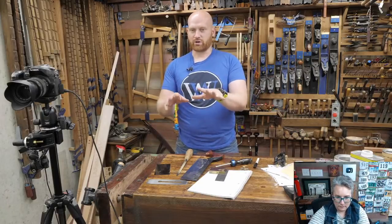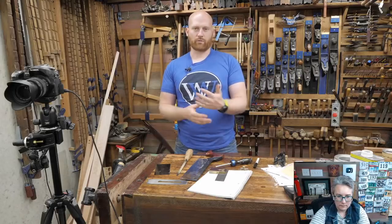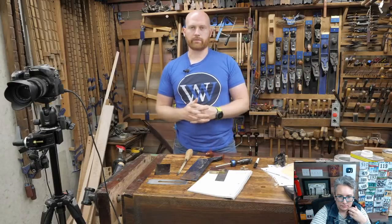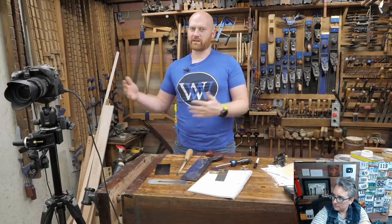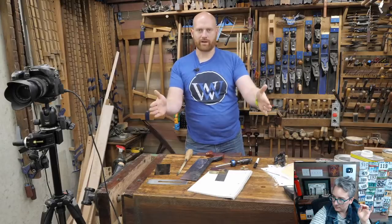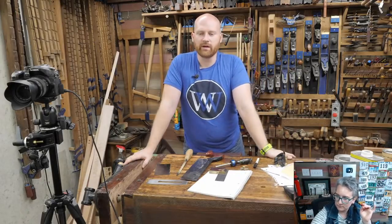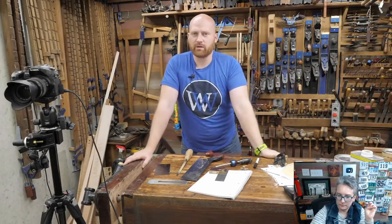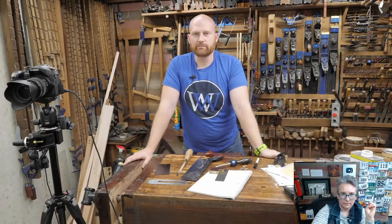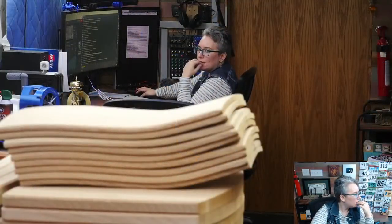So you have to be very, very careful with multi-lamination clamping. We were trying to show the cheaper way with the bench, as in being slightly more affordable, using the common things: a standard vise, big box lumber, regular wood glue, because epoxy is expensive. But that is one of those cases where, if I'm going to do it for myself, I'm probably going to spend the money and get the epoxy, because it gives you far more working time. It allows you to really dial in, and you can put winding sticks on them afterwards and make sure everything's twist free. You spend less time flattening, which means you get a thicker bench top and less work on it. But lots of things to decide one way or the other. Yeah, I'm trying to think if there's anything else.